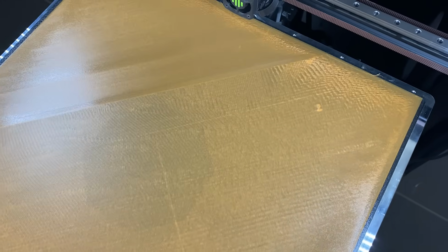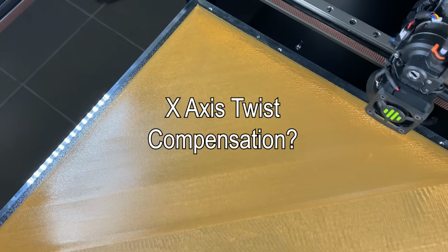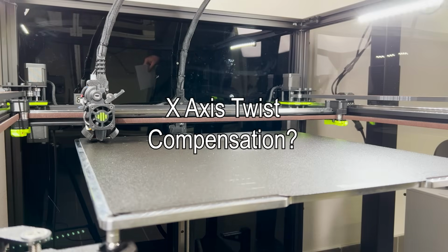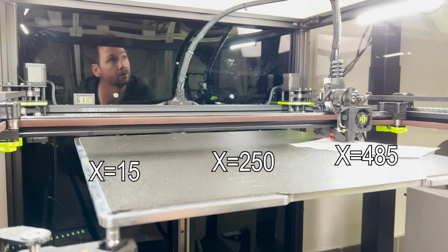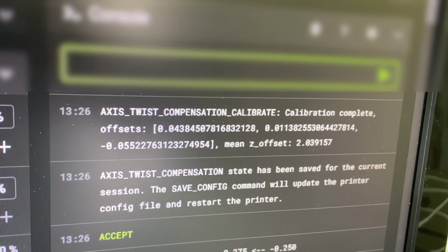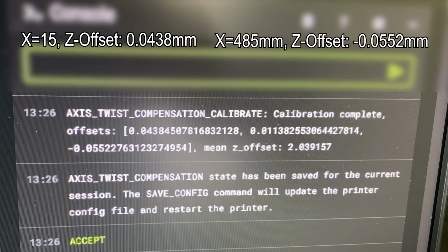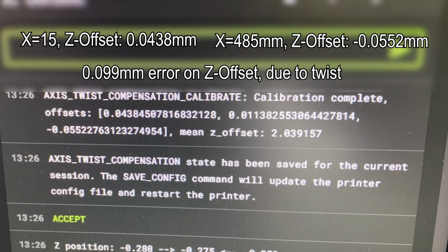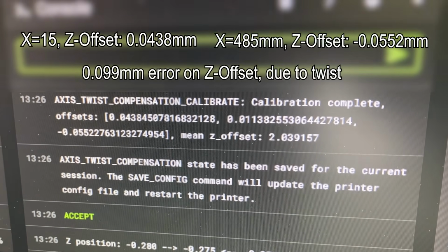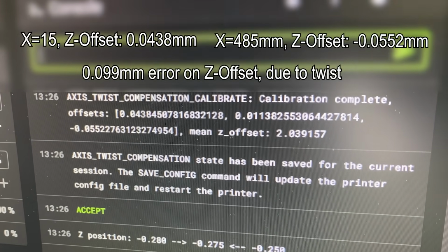until I had to baby step the nozzle quite significantly during printing. My buddy N13D suggested to do an X-axis twist compensation by measuring the nozzle distance to bed at various X positions with the Beacon bed mesh activated. The difference of about 1/10 of a millimeter from far left to far right made sense given the result of that full first layer. Considering the lever effect from the X-beam center to nozzle or from Beacon to nozzle, only a very small twist angle is needed to cause a 1/10 of a millimeter offset from left to right.